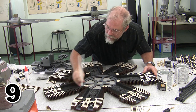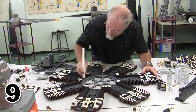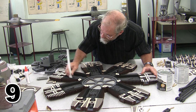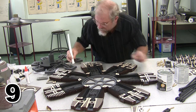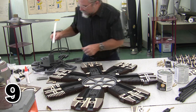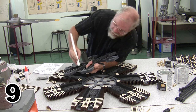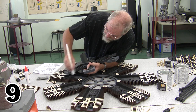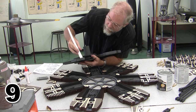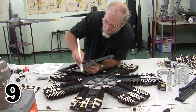So here we are, most of the way around on our wax. Last cylinder. Trying my best to get as much into there as possible. And we have our wax done. Now, as we said, we're going to wax the edges of the pistons, because that's easier than the edges of the cylinders. So there's the edge of one piston, the edge of the next piston. No matter what you do, you're going to wish you waxed more when you're done.